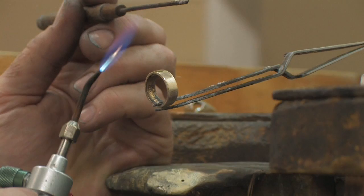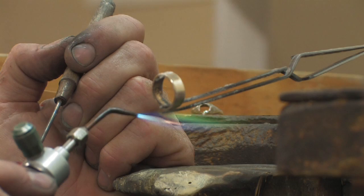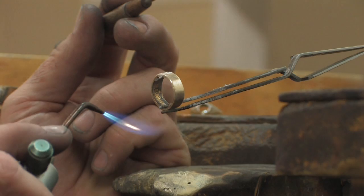You always have to remember when you're soldering gold or silver or platinum that heat is going to go to the coldest point. So if I put my torch here, all of my heat is going down here because this is the coldest point. Because I want control up here, I want this to be the coldest point of the ring. So this is where I'll put my torch last, not first.